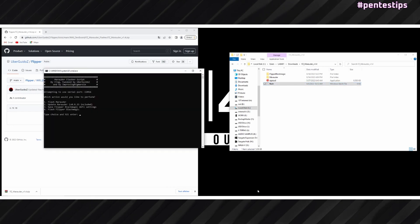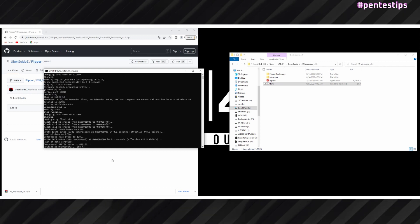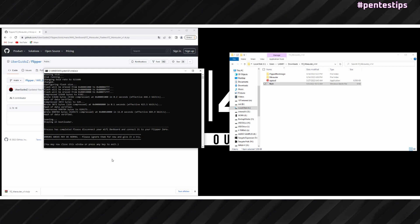Back on the PC, double click on flash.bat. Then choose flash or update. Select 1, flash Marauder. The software erases the current firmware and then prompts the user to confirm the writing. When the writing is finished, just close the window.